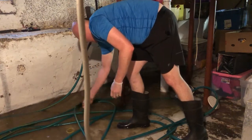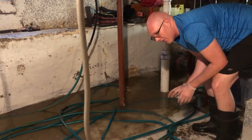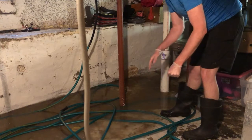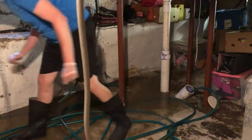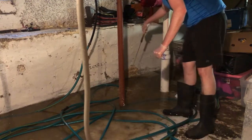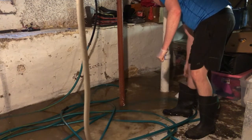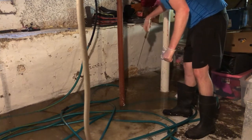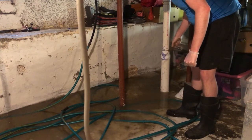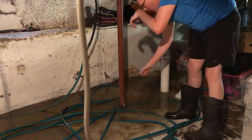This water is, of course, yucky — it's septic, it's sewer water. When we're all done and we get this cleared up, we will be shooting bleach all around this area. I've got a stick over here — it's a real old fishing rod, rusted, no good. I use it to find that floor drain hole. You want to make sure there's nothing just really clogged right there, because if there is, you might not even be able to tell the water is leaving after you have it taken care of. Just kind of clear that out — a little bit of waste paper there. Keep the handle from getting put in the water because the handle is still relatively clean.